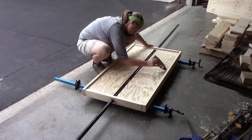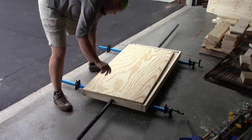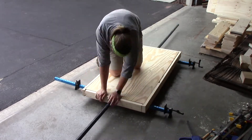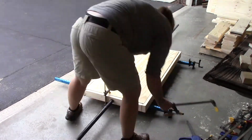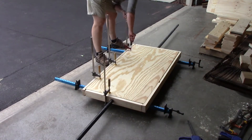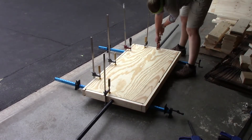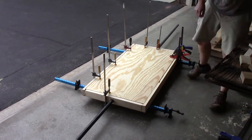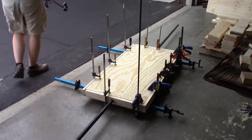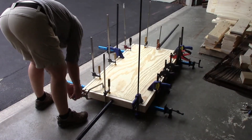I'm applying glue to the notch that we cut out in the frame, making sure I don't apply too much so it will squeeze out when I apply the top board. Making sure the top board lines up with the 2x4s and everything is smooth, I begin clamping it down into place. There's a saying that you can never have too many clamps in your workshop, and on this project I found out that is totally true. Once it's all clamped down it needs to dry overnight before starting the next step.